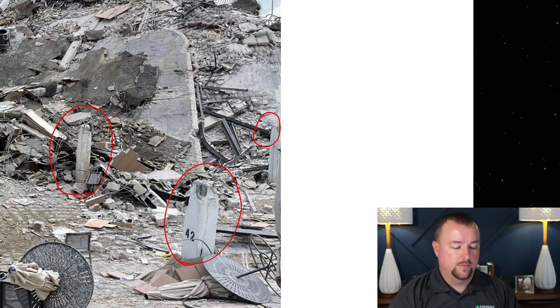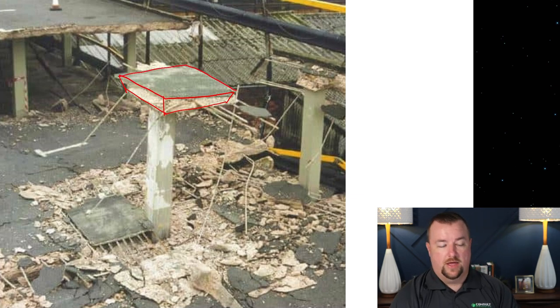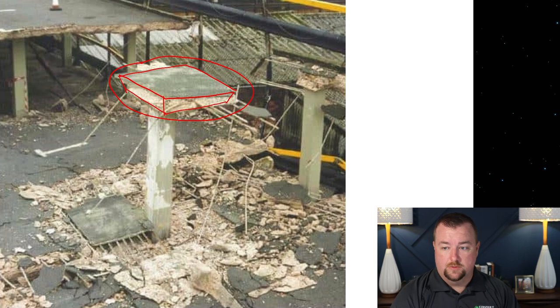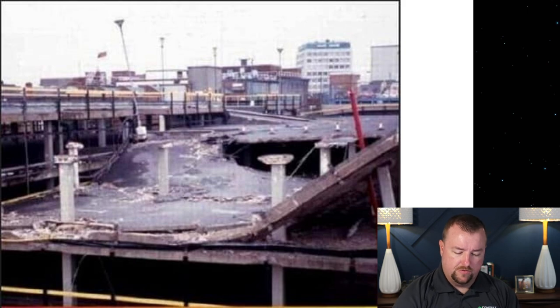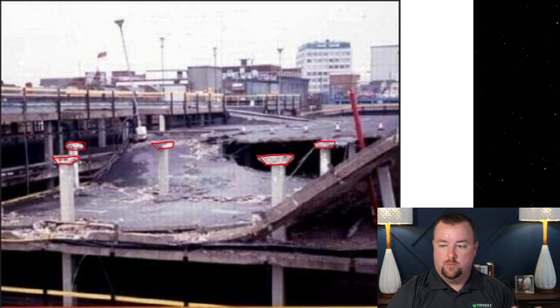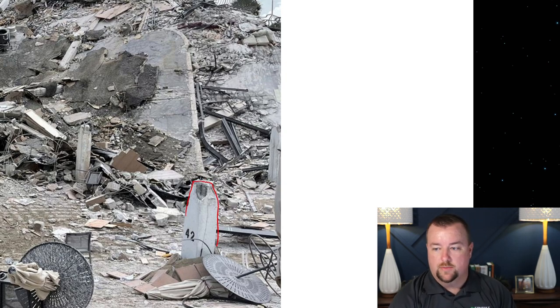I want to show you some historical photos. Here's a case of punching shear at a parking garage in the UK — you can see just how massive the shear head is and the amount of material that was left above the column that had to break. The bigger this is in circumference, the harder it is for that column to punch through the slab. Here's another historical photo showing that telltale head on top of the column where it sheared. Every single one of these columns has a chunk of reinforcement and concrete at the top of it. But we don't have that in our photos — just a straight, almost pencil-head profile coming up through the slab.